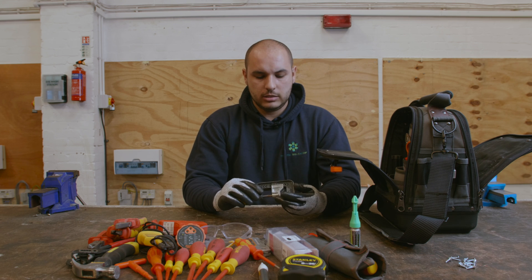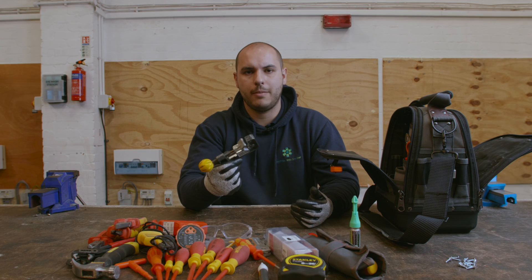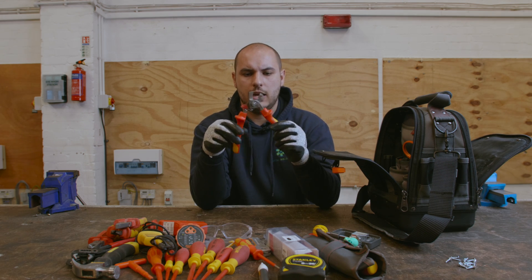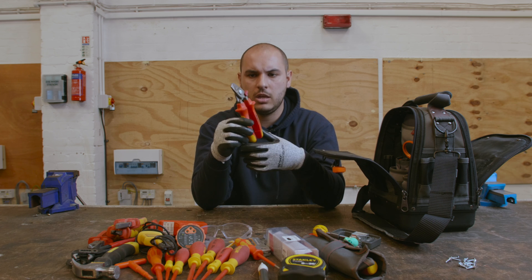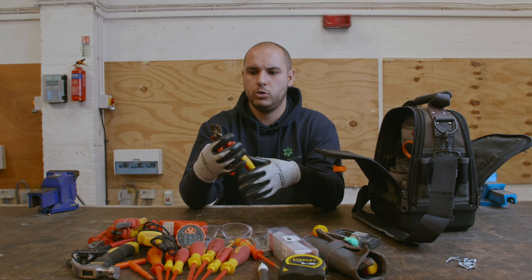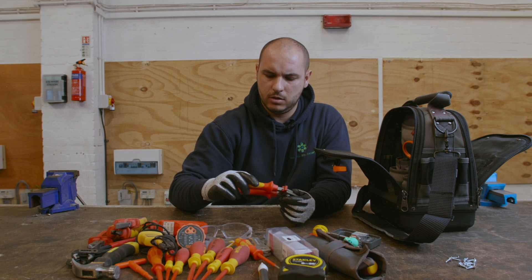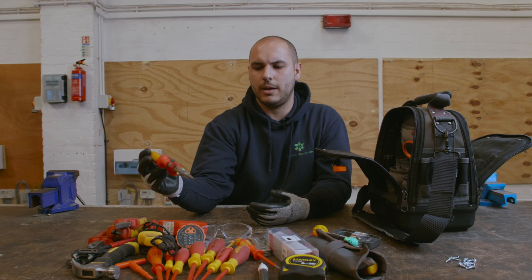Then we have a CK Armor Slice — very useful, really good to use on armoured cable. Good to have handy in the bag — just makes using, cutting, and terminating armoured cable that much easier. Then we have some cable croppers — these are the ones that you can lock off. These are basically used for your mains tails — when you're working with 25mm tails these are really useful, nice and sharp, fit in the hand well, and are easy to use. Just strip those tails ready to terminate the consumer unit switchgear. German made — they're Wil, I think. Had them for quite a while but they're nice and sharp and easy to use.